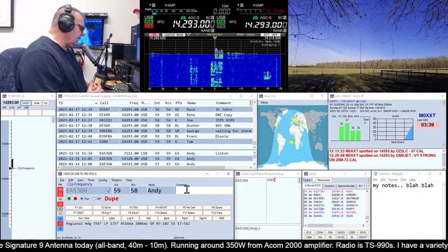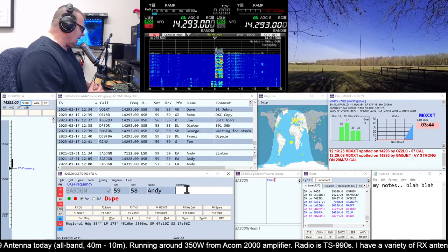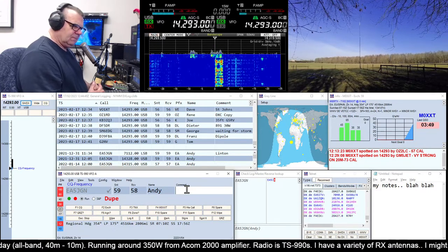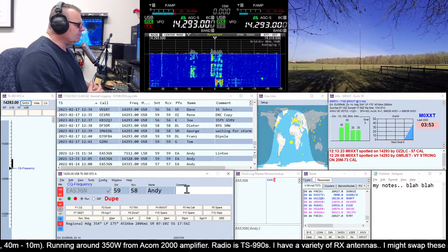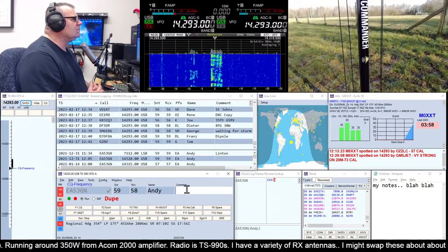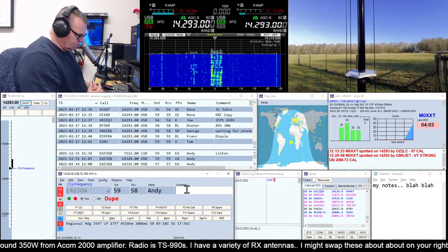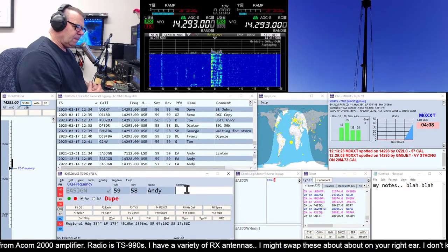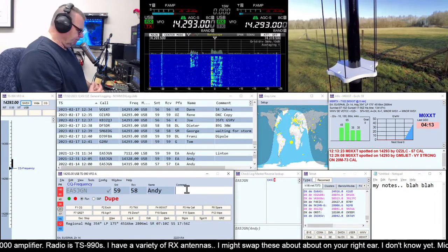Yeah, fair dues, and fine. And is that supposed to be a 50? Is there a matching unit between the amplifier and the antenna, Andy? Yeah, there's where the feed point of the antenna. It's a folded monopole antenna, so a grounded 30-meter tower with wires attached to the top, coming out at a slope, and then back into the base of the tower, which is where they're fed. And there's an ATU there, which is just an L match. It's just a C in parallel and an L in series. And the L is a roller coaster, so that's how I'm tuning it. Go ahead. Okay, fine.